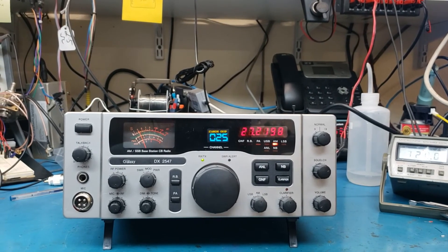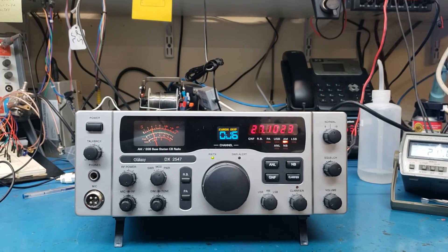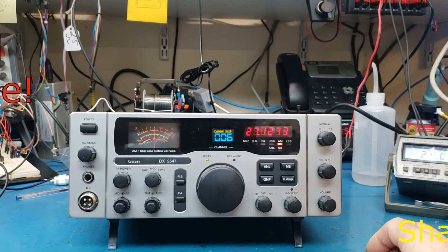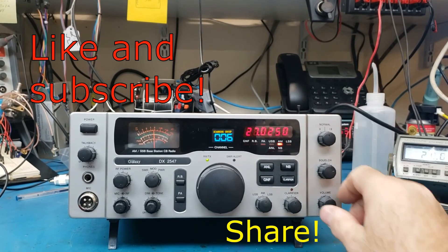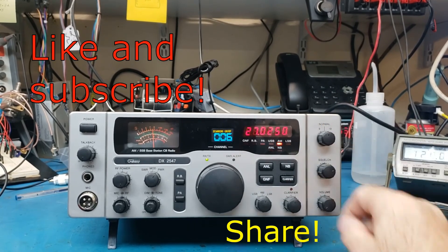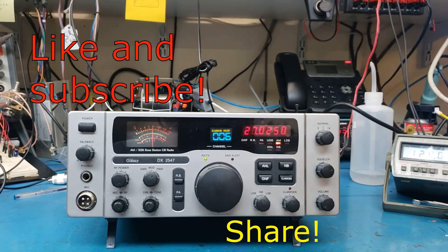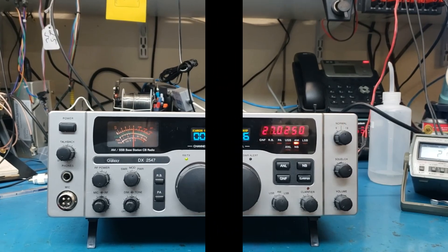Channel six — mother nature. Everything's working. Weasel, I hope you like your radio. We do have the direct inject — you can't see it back there, but the quarter inch jack. Channel 9 is your direct inject — you just key and throw a dead carrier. Normal is your front mic, and 19 is your direct inject from the back quarter inch jack. Have fun with it.